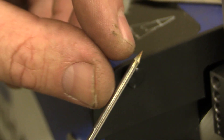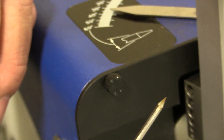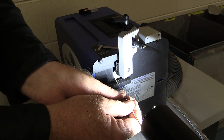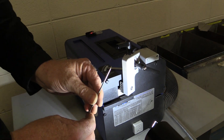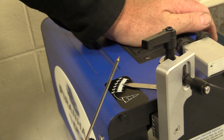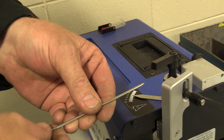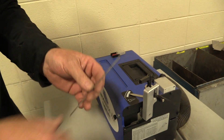The point of the tungsten is super sharp, so it's not a bad idea to blunt the tip of the point off — just come in very carefully and knock the tip off. It'll hold the point a little better. The Piranha is a great machine. Just make sure that when the electrode is touching it, you're spinning the rod in your hand. Now we have a sharpened tungsten and all the components in the TIG torch are tight. Assembly order: collet body first, collet, electrode, cap. If you're using a Dynasty 200, make sure you plug the water cooler into the wall and make sure it's on, or you're going to burn the torch up.